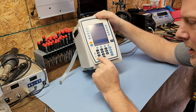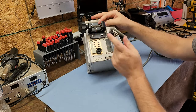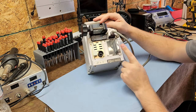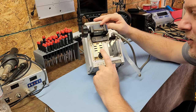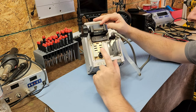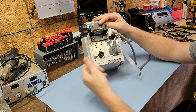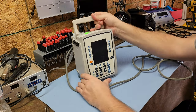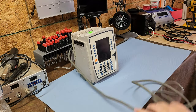The other things include the Wi-Fi, which is on the back. On the back we have a regular pole clamp, a network interface port, a Wi-Fi card — this port serves multiple functions including reflashing — and there's a mysterious little button with several different features. Use your user manual to figure that one out. One thing we can use this button for is during boot to put it into diagnostics mode, which also acts as interface mode to talk to the laptop, because this system uses a laptop to do the PMs.